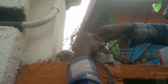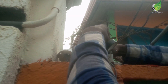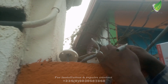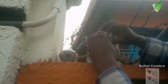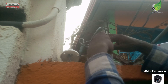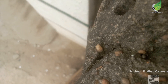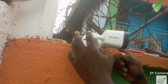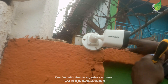I'm going to cover the connections with tape. The reason I'm doing this is because of the type of camera it is — it's an outdoor camera and the back casing is exposed to weather, rain and storm. So I'll put some insulation on my connections to prevent water or any form of moisture from getting into the connection easily. The camera is set up now. I'm going to screw it to the wall and do the camera angle alignment to be sure it captures the angle I want. Thank you for watching — I'll see you some other time, take care.